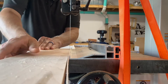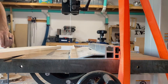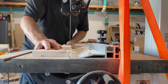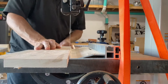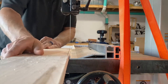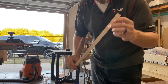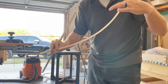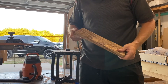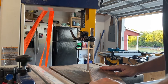Just remember: if you're doing ribbons, they've got to be pliable to fit inside of and bend around any curves you're going to be placing, whether it's in a cutting board or anything decorative you're going to be gluing up. I take the time to make sure that both of them are correct — about a sixteenth of an inch — which should match up with the width of the blade so that I have no gaps.